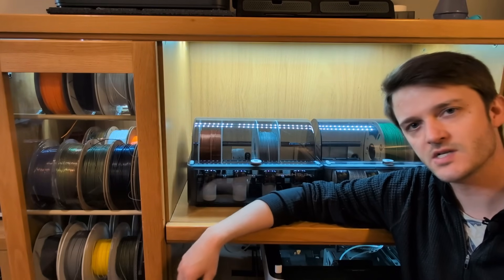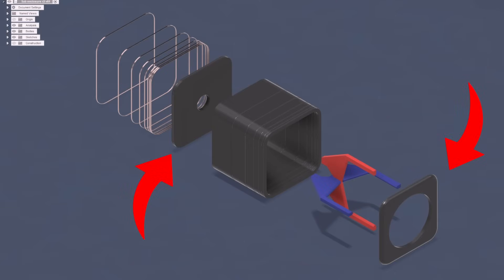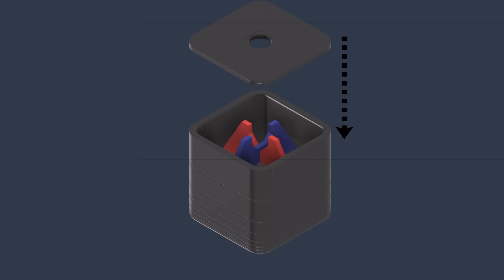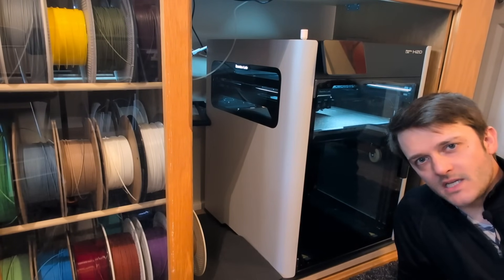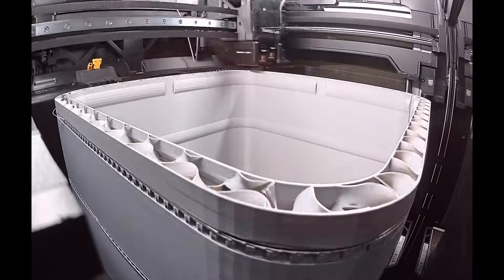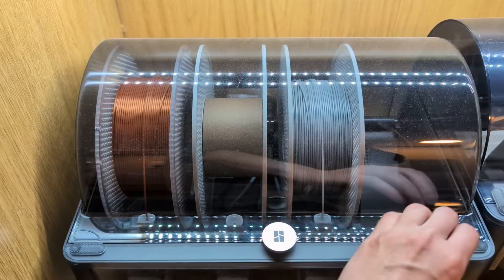Conceptually the design seemed sound, but the transition from digital to physical would prove less than straightforward. I decided to print the front, back, and main walls separately to save on print time and filament. My well thought-out plan was to pull the walls and the front cap and then somehow attach the rear cap later — you're probably thinking that's dumb, and you're right. Additionally, the 4% gyroid infill I'd selected immediately had print quality issues related to bridging and overhangs. I'd also run out of gray PETG, so being impatient, I resorted to the sophisticated solution of slapping some tape over the holes.